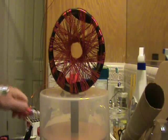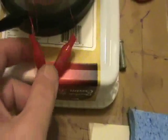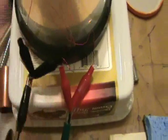Okay, that was fun. I only shocked myself badly once. With this experiment, I'm going to take the hotline and bring it into the primary, so it's coming into both wires of the primary. And a ground wire is grounded to both wires of the secondary. And what I hope to show is sort of the arcing between the two circuits A and B.